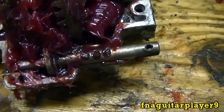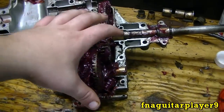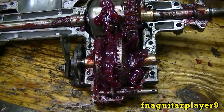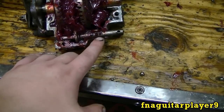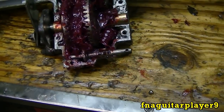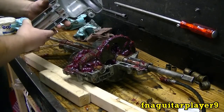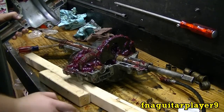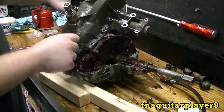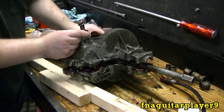Remember that little ball? I'm going to go ahead and put it in the middle slot on your selector here. The grease in there will help it stick. I'm going to raise this up so it's all level and very carefully set it down. I'm going to put two or three bolts in it and check to make sure it's shifting right. If it's not, I'll have to keep playing with it trying to get it in place. You see some of them have a screw right here that you can take out. Also don't forget there's a spring down in there too — just take your time and you should be all right.